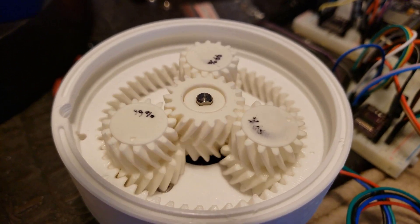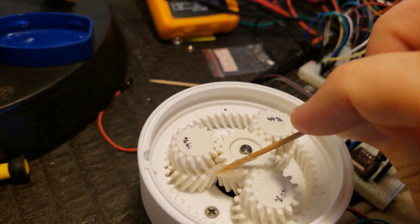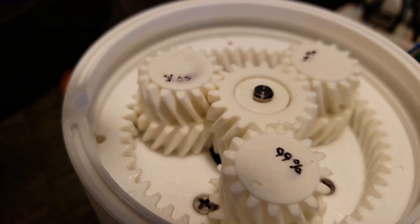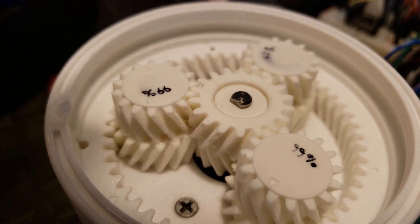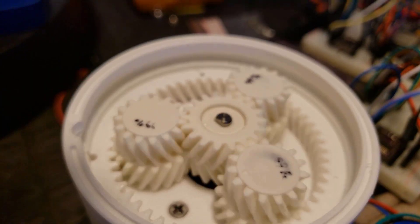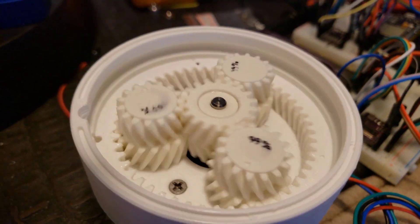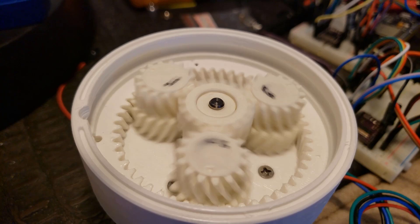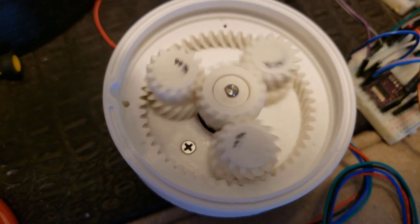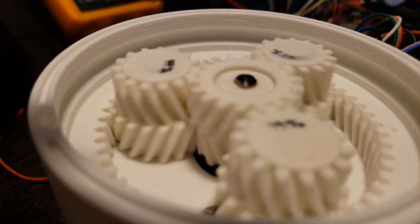Here's that middle sun gear — it can be a little finicky. I ended up doing a lot of filing and sanding. You want to sand that inner track where the Airsoft BBs will go, and also sand between all of the gears. The higher the resolution you print, the cleaner the output, and a slower feed rate ultimately reduces the amount of sanding you'll need to do.